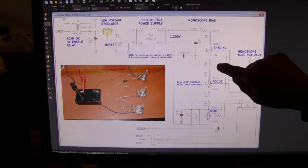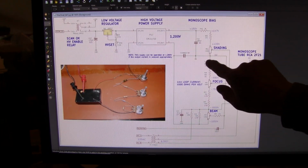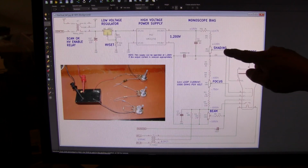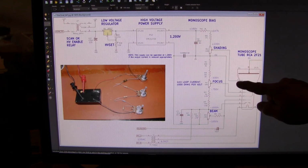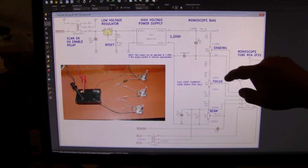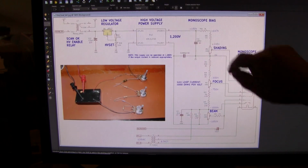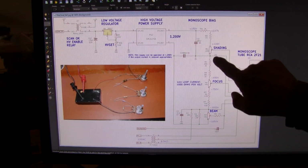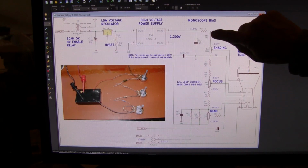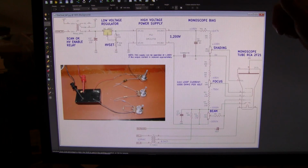So from this point north, we have 100K, which is a 100 volt drop, so that when it's centered, we get our approximate 50 volt collector voltage. These two resistors take care of the additional 50 volt drop to give us the 100 volts at the top of this 100K resistor. This is a 47K and a 3K, which together give us 50K, 50 volts.